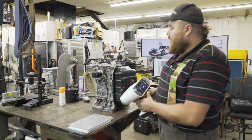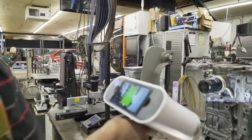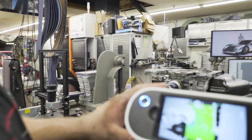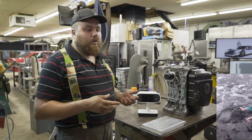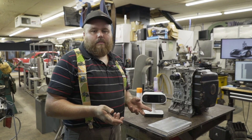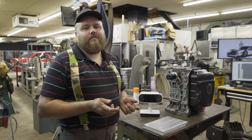One large part of what I do that has really helped us grow: when I first got into machining I bought a 3D scanner, and this is our second one. This is an Artec Leo — it's fully wireless. The 3D scanning really helps me because I can go mobile on-site, scan something, fit existing features, fit around clearances, or copy an existing part. I do a lot of on-call work for factories where something may break and it's a complete one-off piece. By the time the company has it torn down, I've already scanned it, brought the scan home, made a new piece, and have it back at the factory ready for the first shift. It's kind of my favorite work — it's really rewarding getting to see the people aspect of keeping other people working.